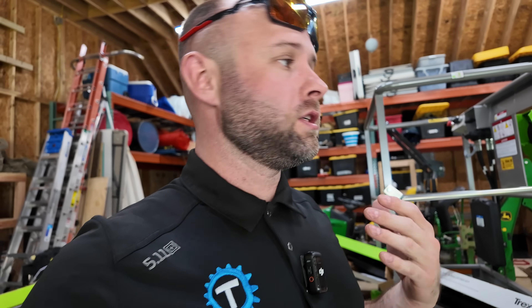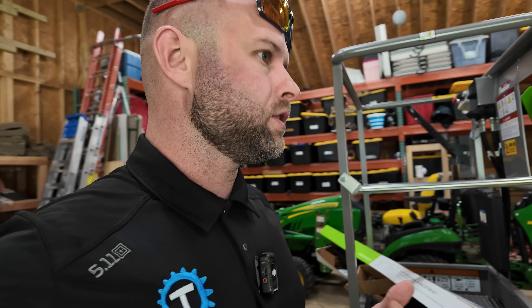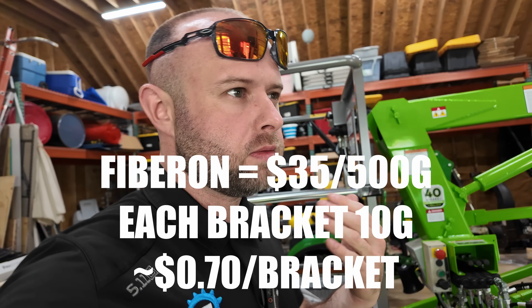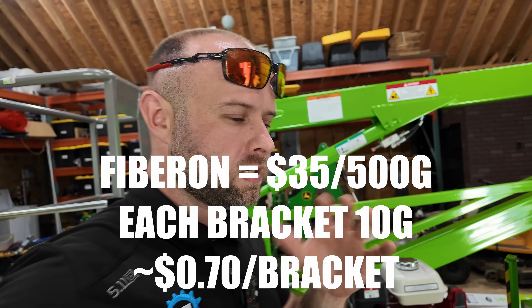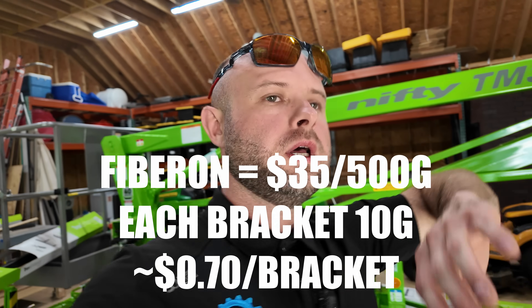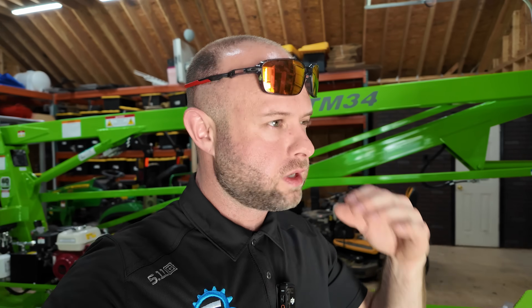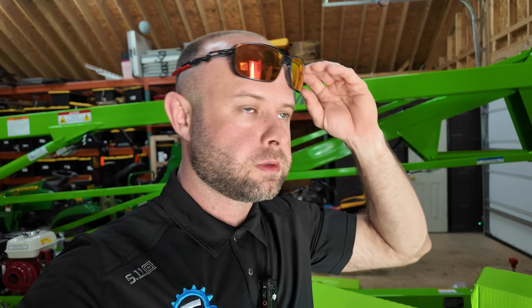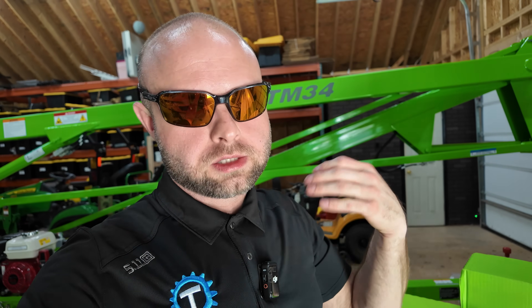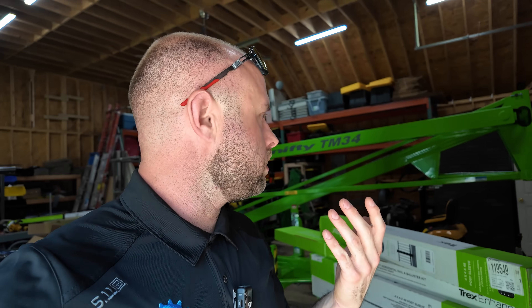It just compresses it into nothing. I'm counting that as a major win. Twenty bucks a piece — for 20 bucks for four extra of those, no way. I went ahead and printed 16 or 24 of them on the Flashforge Adventurer 5M Pro sealed chamber. I dried that filament out for days and days — at about 50°C rather than the recommended higher temp, but I dried it longer and put a ton of desiccant in there. Watching it print it seemed to be doing okay, so that's a major win.